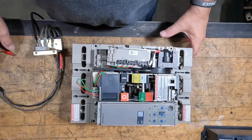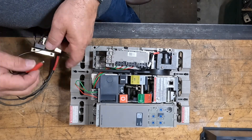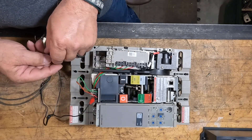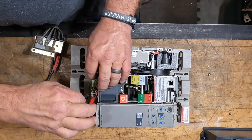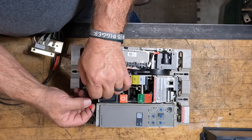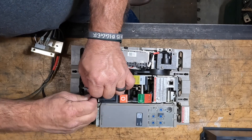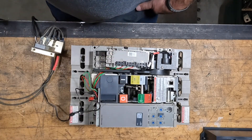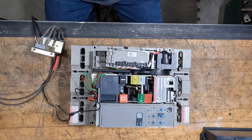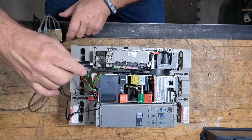For now, I've got to test this motor — I just don't feel right putting the cover on without making sure everything is timed correctly, runs correctly, sounds right, and charges the breaker. Since this one does have an under voltage coil, you have to energize a separate circuit and feed that UV coil — it's got its own little separate terminal strip. Again 24-volt DC — power that up.